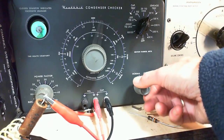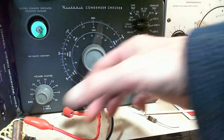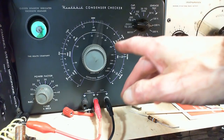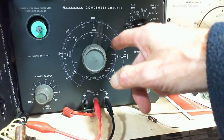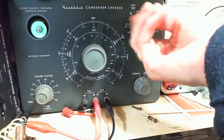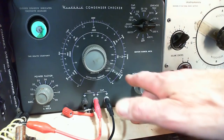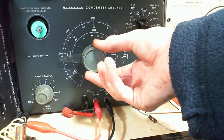Oh my gosh, that's a lot of work. I need to switch cameras. Well, we're going to turn it on now. Now the only question is, did I replace these properly? Turning this guy on. It's all off the power supply. Let's go on standby, turn down the supply voltage, then turn on this guy. We've got one and a half amps flowing into the heaters. Now we'll raise up the B+.